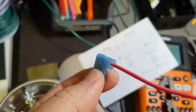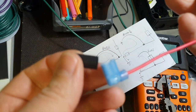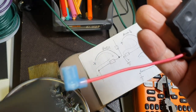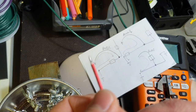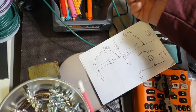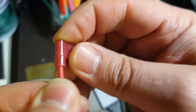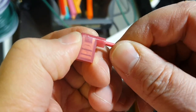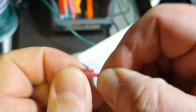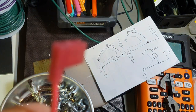So guys, here I crimped it, and now one more time with you, with fewer mistakes. First you put the shrinking tube, because you cannot put it on later, and if you use a bigger diameter it won't shrink on this small cable. So first we put the tube. I will explain soon why. It doesn't fit on the red one because it's tinted. Yeah, so it doesn't fit here. Well, this time it fits. Come on, come on. Let me check it first. Yeah, another end didn't fit, but this one is okay. So then I show you on the red one, but it's similar.